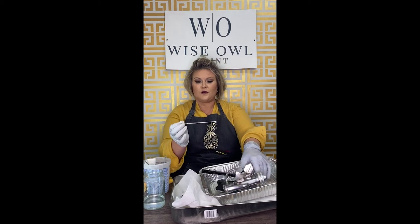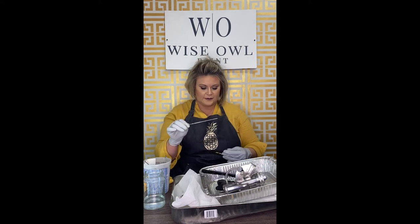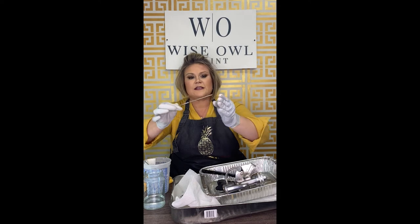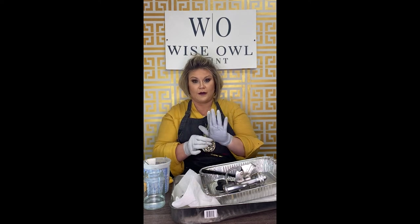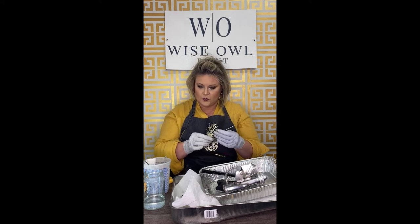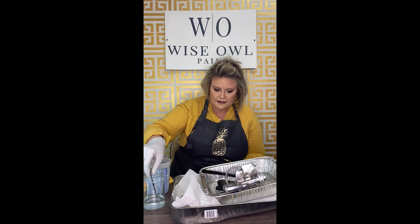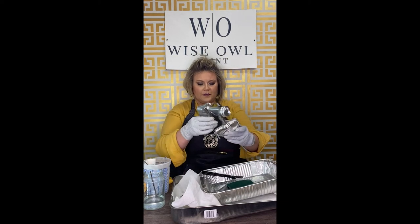The spray needle on the metal edition cup will look different than the plastic one. It's a little bit longer, and there is still, I should have showed it to you before, a bunch of 1 hour enamel, white, just stuck to this. I mean, it was stuck. And there's some on the tip. So what you're going to do, I have this little jar, carefully place that in there so it can start soaking.